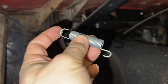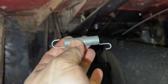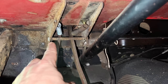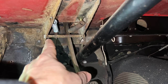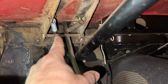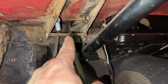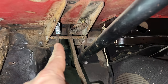The springs are not symmetrical — the large end goes through the pedals and the smaller end goes through the pedal box assembly. The return springs are now installed; I had to get one new one but found one of the old ones. This bar limits how far the pedal can come up. I found that having the bar out gave much better access to put the springs into the holes on the pedals. I recommend putting this side of the spring through the pedal box holes first, then through the pedals — that's what I found to be the easiest.